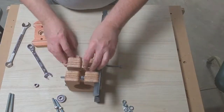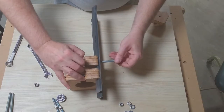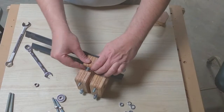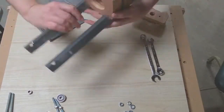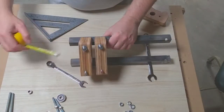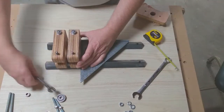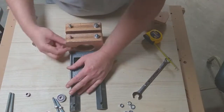That cutout area allows the wooden clamps to compress onto the router, and these bolts extend all the way through so nuts on the outside will compress the wood clamps onto the router. It's important to have these pieces 90 degrees to the angle iron rails, so that's what I'm adjusting here and making sure the measurements are correct. I may publish a plan set for this at one point with all that particular information.